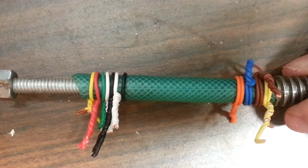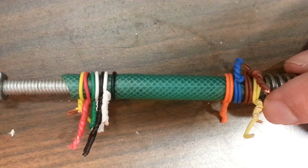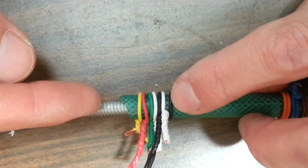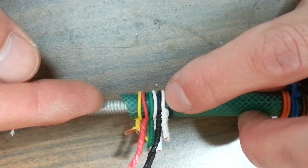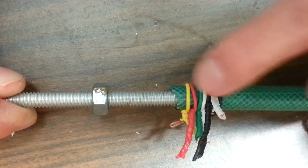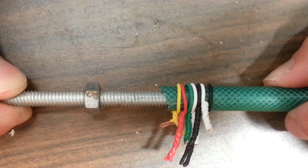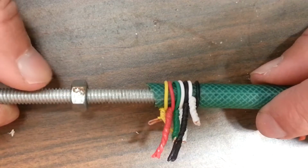I haven't seen any videos talking about the pull of weight on the Z-axis. I was worried that my stepper motor would be in a configuration where the shaft was pulling away from the stepper shaft, and there's probably no, I don't know, what is that called, a thrust bearing or something for that. Usually, you know, your steppers are mounted horizontally and they don't have weight pulling this away from their shaft. So I think I'll probably put in a linear force tape spring, you know, kind of like a garage door opener spring. It has no weight, but it pulls with a certain force constantly.